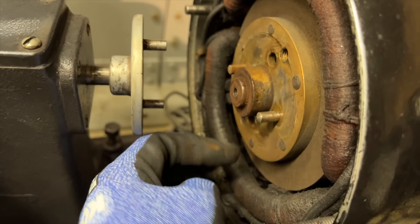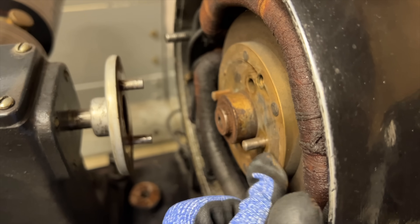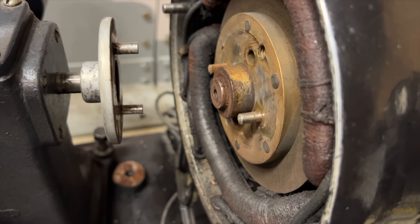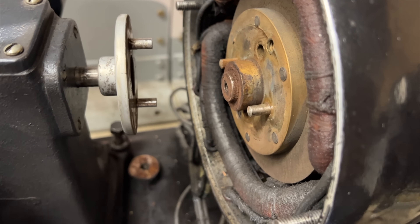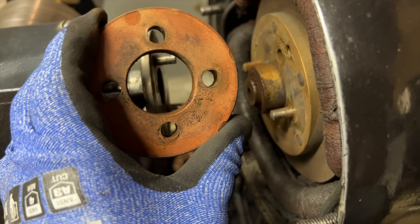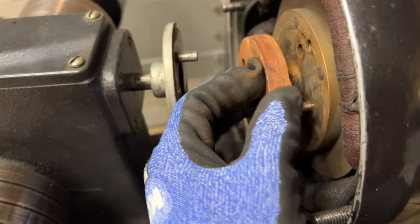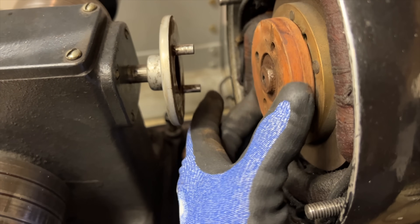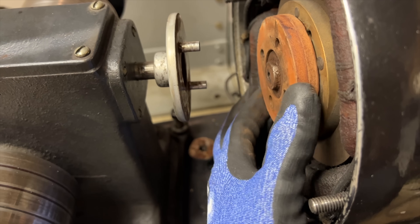It's pretty clear that this is going to need some love before it slides off into my hand. But the nice thing is there isn't any real serious wear here like I've seen on the other machines. So it's very apparent that they didn't run this machine very much, which makes sense because it's the DC machine. This is the leather coupler that's very shriveled and worn out — it's going to get smaller and kind of dry out with age. And it should be tight on these pins, and it very much is not.